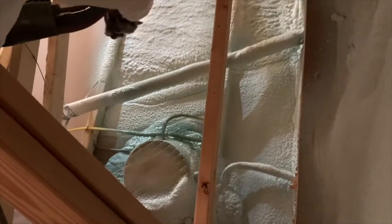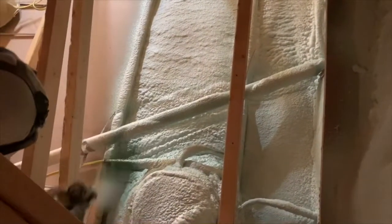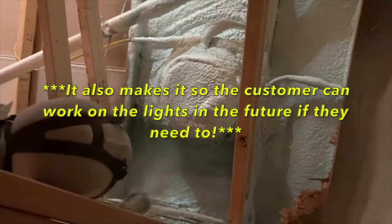Basically all we have to do is put this cover over top of the light, then spray a couple inches on it on the first pass, and then we come back through and do our second pass. We spray the amount we need to meet code up to it and around it. Even with IC rated lights, we don't want to risk the customer having any flickering lights, so we put that cover over top with an air gap around it so the heat will dissipate down towards the house.